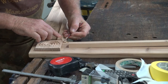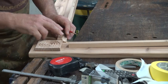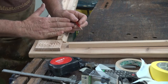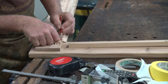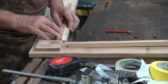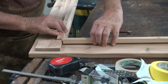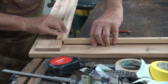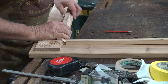So these scotias line, and then what I'm going to do with the carving chisel, I'll have to glue that on. And then with the carving chisel, I'm going to feather this out so it just becomes below the level of the rondelle, and that'll give it a nice moulding. Plus what I've done, I've given myself a few extra mil in front of the glass and everything. So that will do the business, I think. We go from there to there.